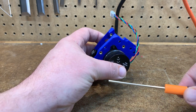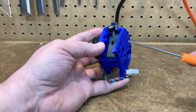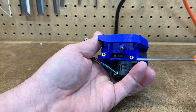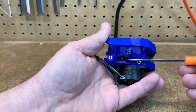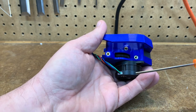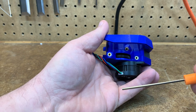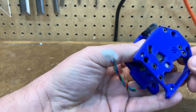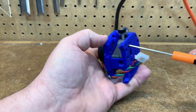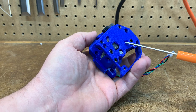While I've got this new stealth burner sitting out, I wanted to show you guys how to do that. The important part about the backlash between the 50-tooth gear, which is right here, and the 10-tooth gear that's on the motor is: if you've got it set like I've got it right now — I'm pushing back and forth on this — there's no play between those two gears. Now, that might sound great that everything's nice and tight, but what's going to happen is you're going to prematurely wear the plastic gear here because those teeth are too tight. You want a little bit of play between those, but not a ton. If you've got too much play, it'll be imprecise. If you've got not enough play, they're going to wear prematurely, and that's not a good situation either.